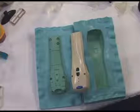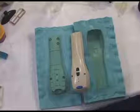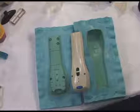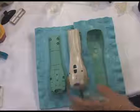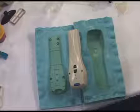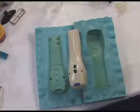Another product and service we'd like to highlight is our ability to make RTV molds. RTV stands for room temperature vulcanization, where we take a stereolithography piece, pour silicone rubber around it, and then inject a two-part urethane into that mold. We have the capability of making a urethane casting that duplicates an injection molded piece — for customers who want 25 pieces without spending a lot of money on injection molding, at a much lower cost and a very reduced lead time.